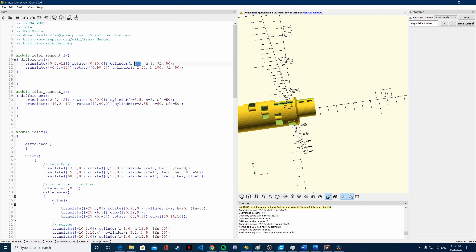The radius should not be 8.5 — it should be 11.5 so that we have enough clearance for our 22mm diameter bearing. Now we are going to do the same on the bottom: 11.5. We are keeping about the same clearance as the original design so there should not be any problem. Now we have to edit the axis for each bearing — it is not 2.55 in radius but should be 3.95. It's a bit smaller, so 4 would be a perfect fit, but since we want to slide it on, we need a little bit of clearance in order to easily install the bearings once printed.